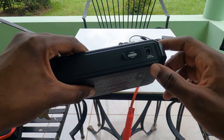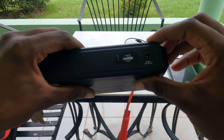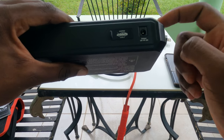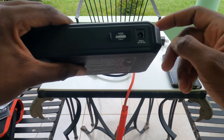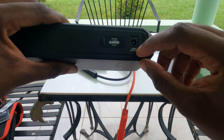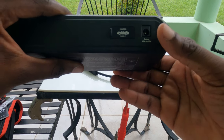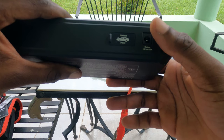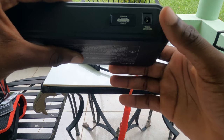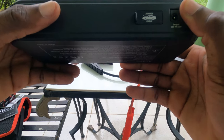This output port is one I actually use quite a bit to charge my FPV drones — that was actually the backup reason I bought this in the first place. It outputs 15 volts at 10 amps, which is 150 watts. That's been pretty consistent; I would use this to charge two or three drone batteries from a fully discharged state of around 3.6 volts per cell.